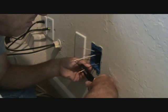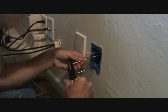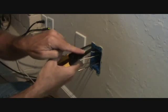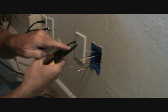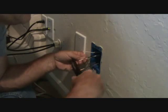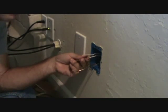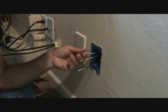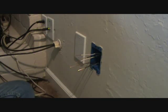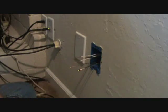I'm stripping back about three-quarters of an inch — enough for the curlicue and a little bit extra. I've got 12-gauge wire; I set the stripper to the 12-gauge hole, which is good for 18, 16, 14, 12, and 10 gauge. I check that the white one is stripped far enough and give the black one just a hair more length as well.